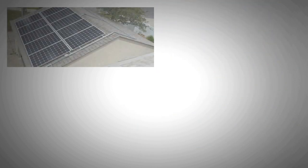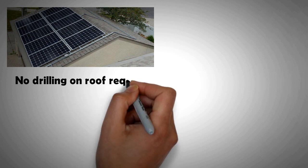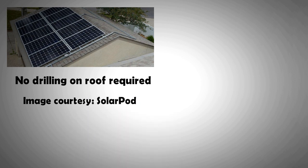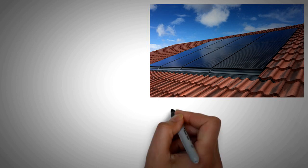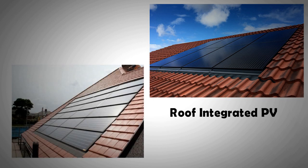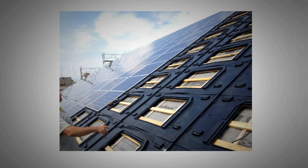More interestingly, a system has been developed that requires none or minimal invasion on roof structures — solar panels can be mounted without drilling any holes in the roof, although this system requires local wind conditions to be below a certain threshold. Another development in non-obtrusive solar installation is roof-integrated PV, which replaces the tiles altogether — instead of panels being mounted on top of tiles, the panels replace them to become the roof. Specialist installers are required for such installations along with a particular solar roofing membrane.